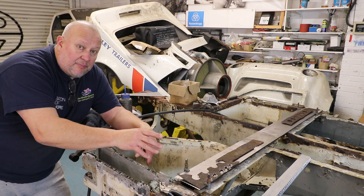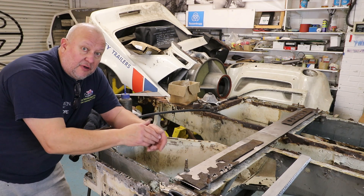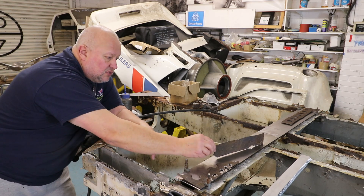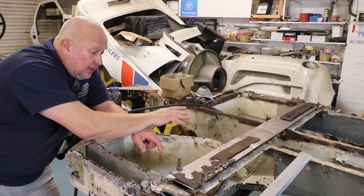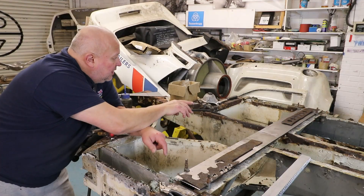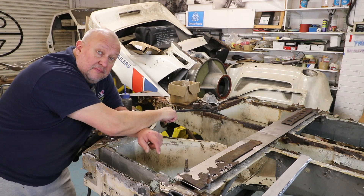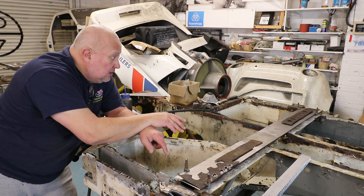I'm making a start on the new cap for the cross member. I've cut a piece of steel — actually three pieces, off-cuts joined together, doesn't take long. I've made a new cap for the top and placed the old scrap pieces on there because they have lightning holes in them. I want to get the position and size exactly right. There are four at this end, none in the middle, and seven at that end — all shoved over to one side. I think I know why, so I'm going to put the swage holes in and we'll have a look.